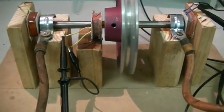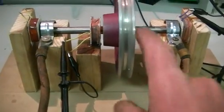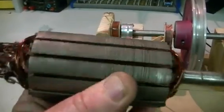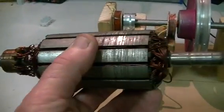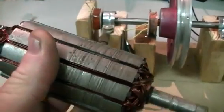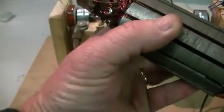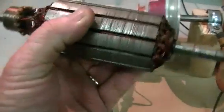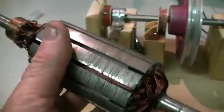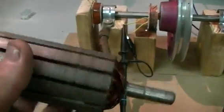It does spin, but I'm not very impressed, and I'm just wondering if it's something to do with the aluminium because he actually had a steel rotor on his. We have seen others that are just using the guts out of a motor. This one here happens to be exactly the same as the one that shaft came out of. So in our next test, I'm going to swap this aluminium rotor and shaft out for this steel rotor and shaft, and see if that makes any difference to the speed. I'm also going to try it just with the shaft itself with no rotor.